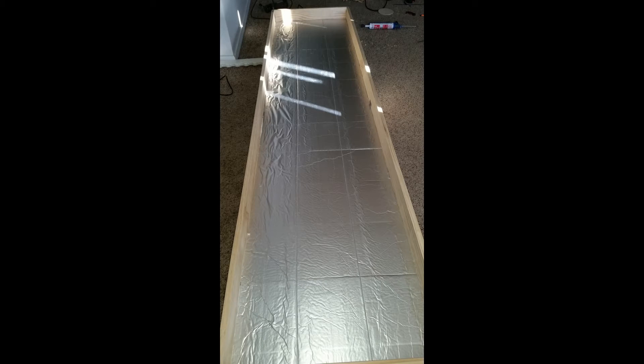There's a six inch ducting that protrudes through the back of the solar heater on the top and the bottom, which will provide an inlet and an outlet for the air. I then cut the poly isocyanurate insulation foam, which is used in high temperature applications and doesn't melt, to the required dimensions, then spread silicone sealant on the back and pushed the insulation into place.